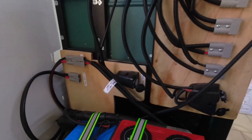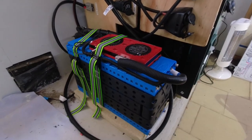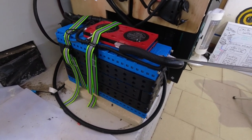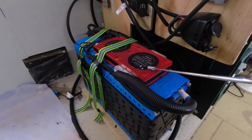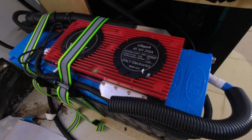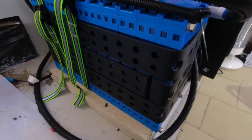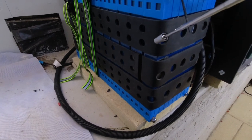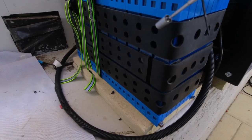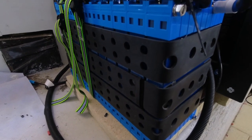It's just a simple plywood panel with the sockets and plugs screwed to it. This is what the system looks like when I've removed it and put it into the back of my utility vehicle. This is a KEL 12 volt 240 amp-hour battery with a 250 amp battery management system, made by Delhi Electronics. I've put rubber belt strips on the side with punched holes to provide some impact resistance protection, while the holes still allow heat exchange and proper cooling.